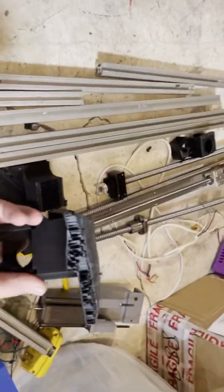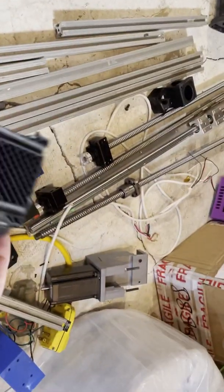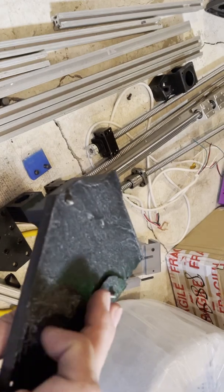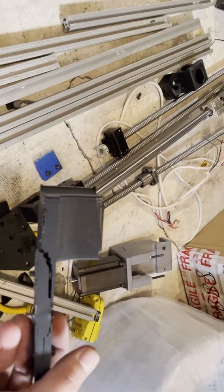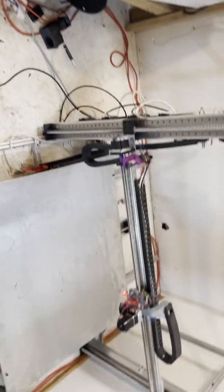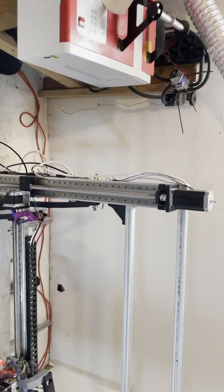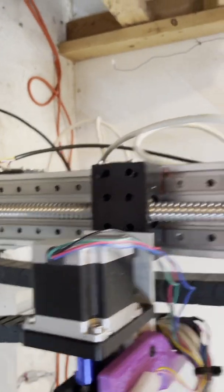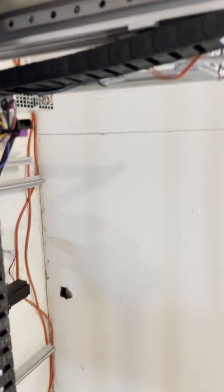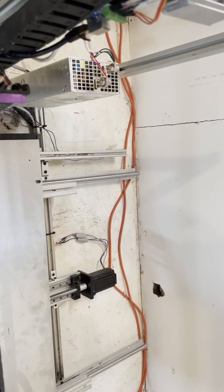this is where the catastrophic failure was. Basically, my X or my Y axis broke and caused the Z to miss the bed when I was homing it. I stepped away for a minute and kabamo. Found stepper motors on the floor, falling over, and all sorts of stuff. So I decided I wanted to really strengthen that part of it up. These are NEMA 23 motors. This one's a small one, but the Z's are big, and the Y is actually like a 500 ounce motor, so it's ginormous.